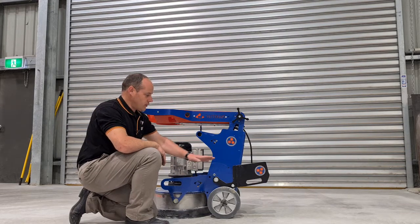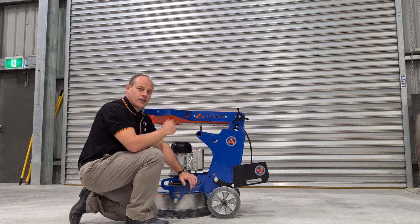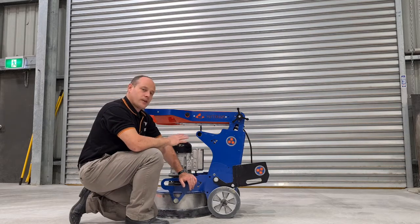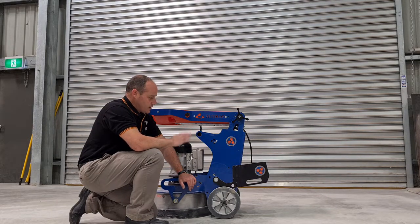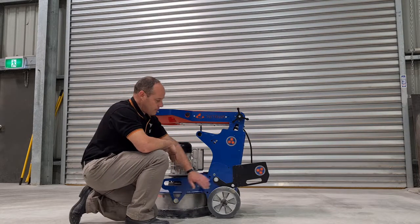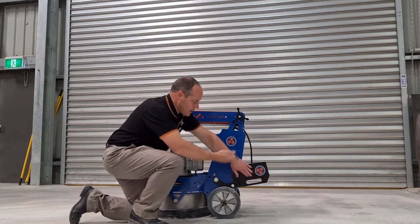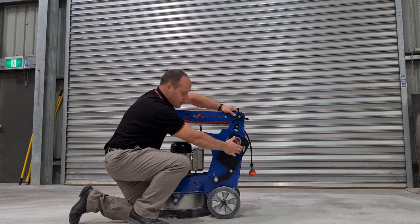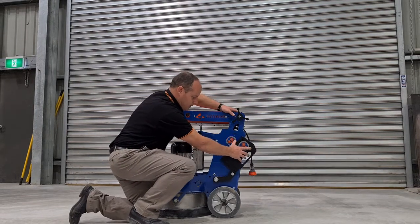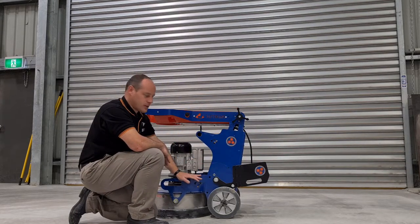Very simple. You can do one side or both depending on how much load you need to take off the head. It won't affect the grinding process if you have just one back. Obviously when you tilt the machine backwards and the weight is in this position, the weight will just rest on the floor, but it will come up out of the way while you're doing the work under the head. Then you can move it back down once the machine is back into the grinding position.